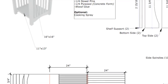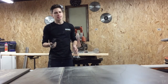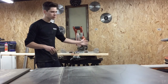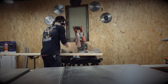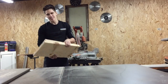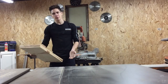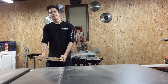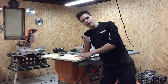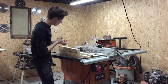Now it's time to build with the pine board. On your screen you'll see red dashed lines — those are where we cross cut. We only allowed for a certain amount of material in the design, so you can't cut at random lengths. The first two cross cuts are 24 inches wide — always wear safety glasses and ear protection. Pine smells amazing, like a Christmas tree farm. Now that we have these two pieces, looking at the drawing we're ripping six and a half inch pieces on the first board, then the other two on the next. Set blade height to just a quarter inch above the material.